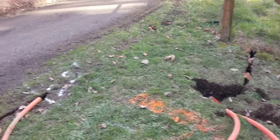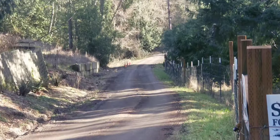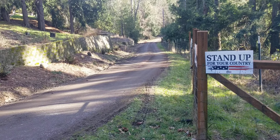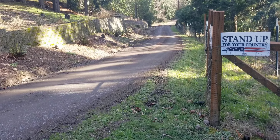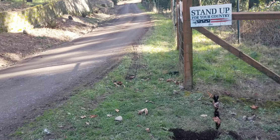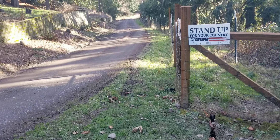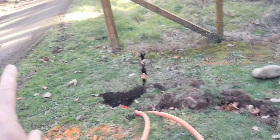This shot is short, but they also went from there all the way down to those cones in one shot. At work we shoot about 500 feet, which is quite a ways. Since this is going downhill, when you're boring you want the head to match the contour of the road — get it down about 30 inches and keep it at that angle, maybe about 12% downgrade. Before you start you can lay the machine on the ground, put a level on it, find the exact road angle, and maintain that through the locator.